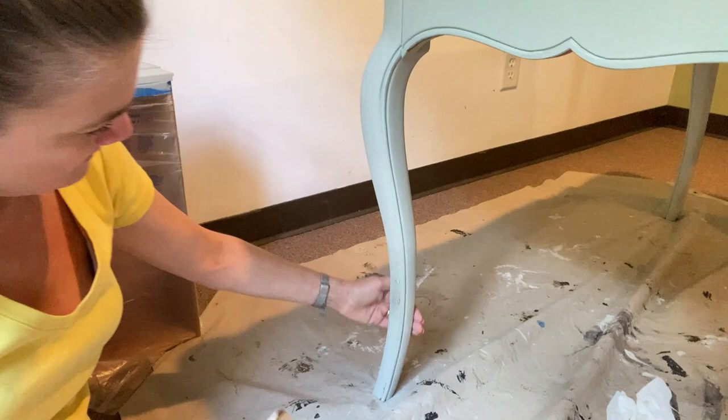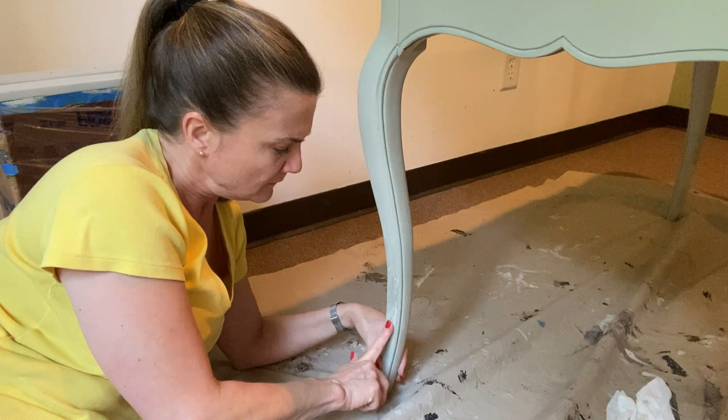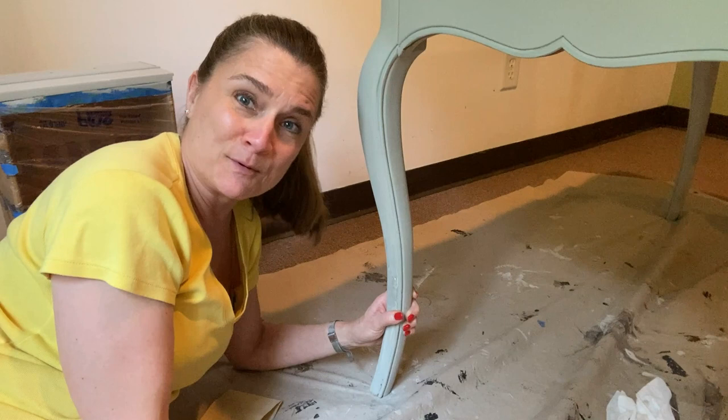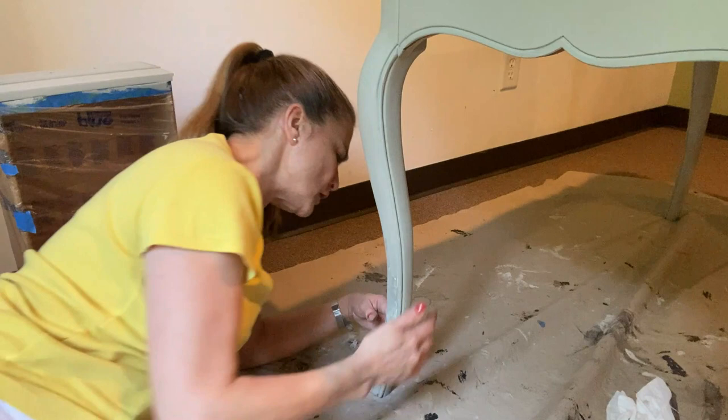Now this was bad damage, and I think overall it looks very, very good. There's a spot here I need to smooth out a little bit, but this discoloration will disappear once I put the paint on. Even probably the second coat of primer will cover that up. But I am going to finish sanding this. I'll treat this spot with some shellac as well, and then that second coat of primer. But I am pleased. I think it looks pretty good.